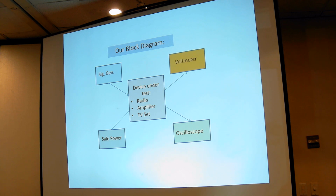It's one that was made in about 1946, I think, or 45, and by that time the Underwriters Laboratories were pretty strong about keeping chassis from being tied directly to the power line. So this one has a floating chassis, but it does have some leakage to the power line, and I'm hoping that that leakage is not enough to set off a GFCI protection, which I don't think this hotel has anyhow, so I think we're safe. I'll probably just get electrocuted instead.